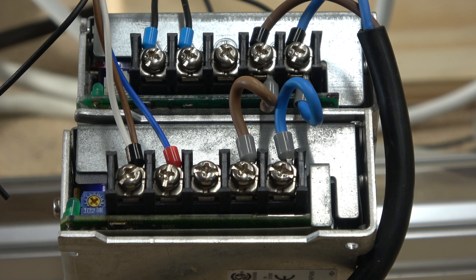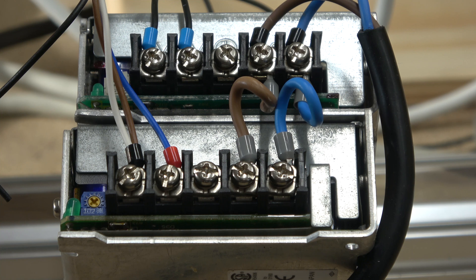In my system I am using two different power supplies - one is driving the controller and motor, and the other is driving the inputs and outputs. The reason I'm doing that is because the manual says you should not use the same power supply for both. If you are running DC motors and things like that, try to separate them from the controller, because induction in those motors causes all sorts of problems you don't want in sensitive electronics.